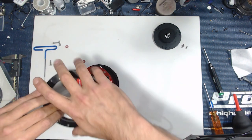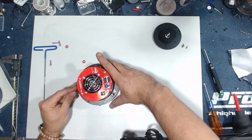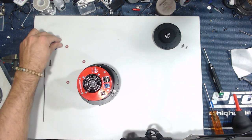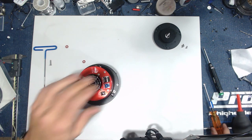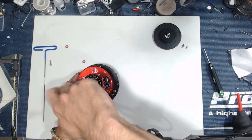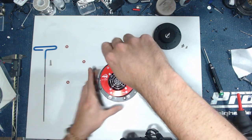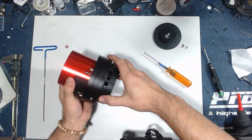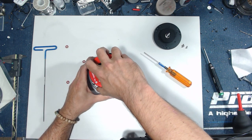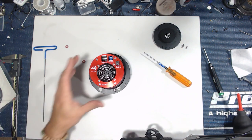We're pretty much ready to go — I'm going to drop the camera inside. It only fits a certain way, and you can see we've got plenty of wiggle room. Then we take the top ring and place it on top — there are holes where everything lines up, and we put the three M2.5 bolts back in. We go around in a robin pattern and don't tighten them all at once so everything is even. Now everything is joined together in one piece — the camera can float side to side and move up and down.